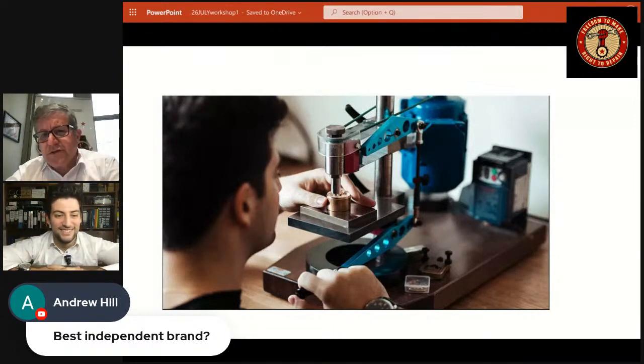Okay. Well, it serves another purpose, and that is to hide machining marks on a watch part. For example, you are applying perlage on a main plate of our watch, which is machined. And then we do particle blasting, which removes a lot of marks as well. So in essence, we don't have to apply perlage, but applying perlage is a kind of mark of quality. And yes, it does take a bit of time.